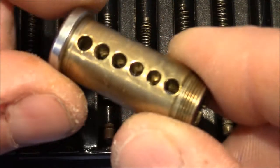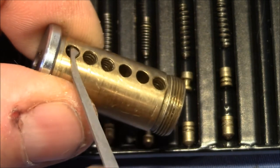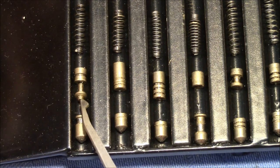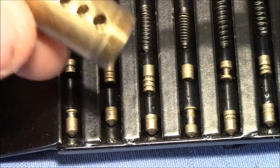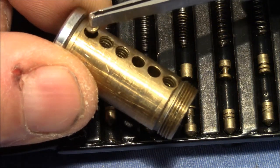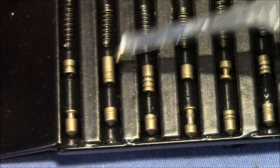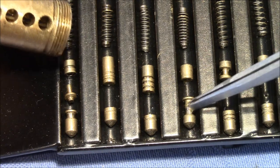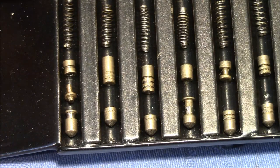And then let's have a look at the plug. We have an undercut here, where driver number one nicely falls into. So if you are caught in here, then that's probably very hard to escape. Like so. Nasty, nasty. And here, this overset trap. I think these two are the most difficult pin stacks in this lock.